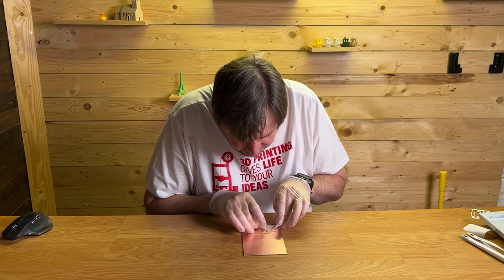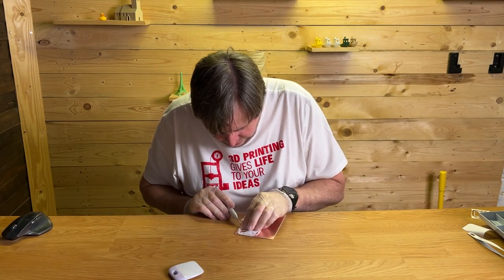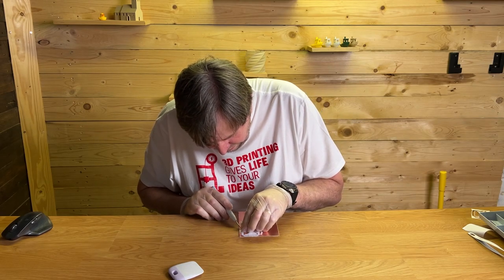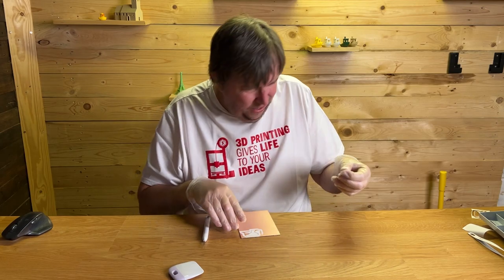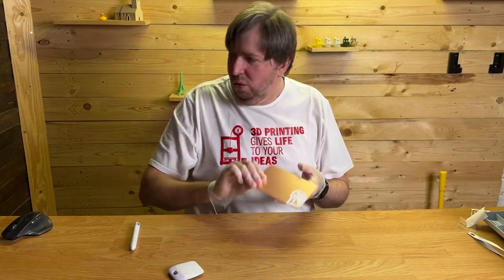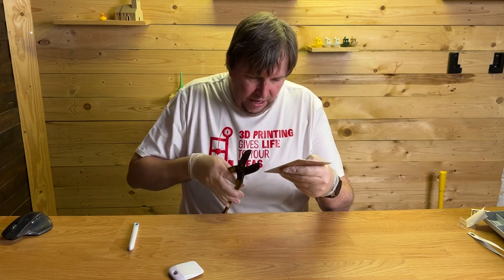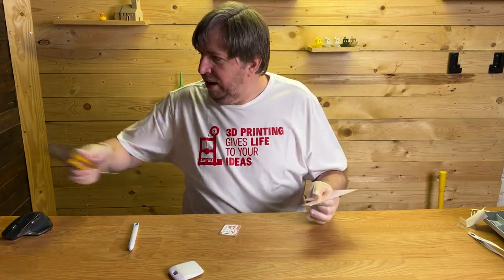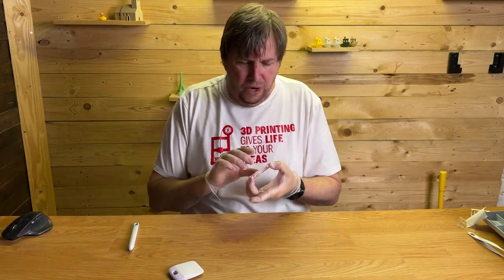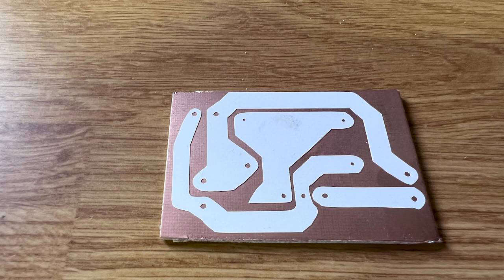I'm going to mount this on my PC board and try to get it straight, then peel our transfer tape off — and there we go. We have successfully transferred that across the board. Now I'm just going to use a trusty pair of tin snips — very old tin snips — just to cut this board out. I'll try to cut it straight. I could use a Dremel to cut it as well, probably a little bit straighter, but there we go. Now we've got our vinyl transferred across to our PC board, and doesn't it look amazing?